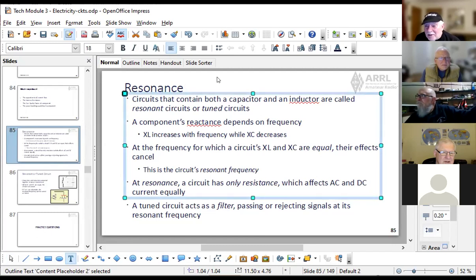Okay, Mike is holding up an antenna. It's an antenna that I was working on that I haven't finished yet, but it's for 2 meter and 70 centimeter. And this coil right here is the trap that Jerry's talking about. So when I'm using 70 centimeter, the wave will only use this piece of the antenna. But when I'm using 2 meter, it uses the whole antenna from end to end. And there's no capacitor in there because the capacitive quality of the antenna wire itself is enough at that frequency to work. Right.